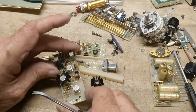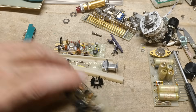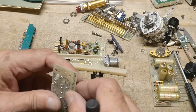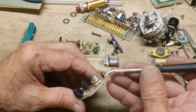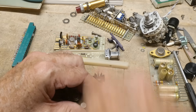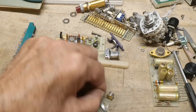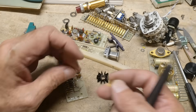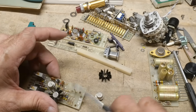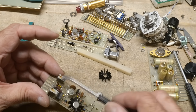This is just a 2N4035, just a homebrew little thing. Another interesting thing about these boards: this one just has a standoff. In the old days, they would put little spacers underneath your transistors so they wouldn't short out, because the cases kind of went everywhere. So you'd get these little plastic thingamajigs to stick in there and space your transistor off the board. They used a little bit of some kind of goo to lock down the adjustments here.